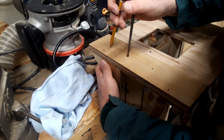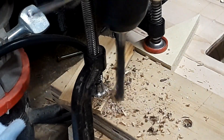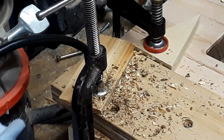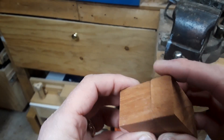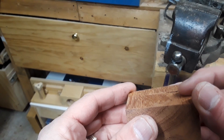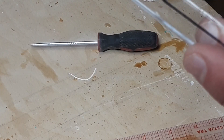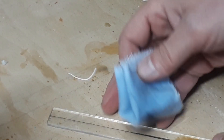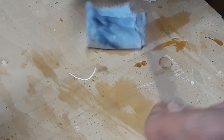The same thing was done on the other side, using the now single screw as the pivot point for the second slot. If you look closely you'll see a board clamp below the template. Rotating the top, I was now able to get my template slot parallel to that board. I then made a centering template for the mortise side template — I cut a piece of Lexan the width of the slot, carefully scribed a line down the middle, colored it in with a Sharpie, and wiped off the excess with mineral spirits, leaving a perfect hairline down the middle.